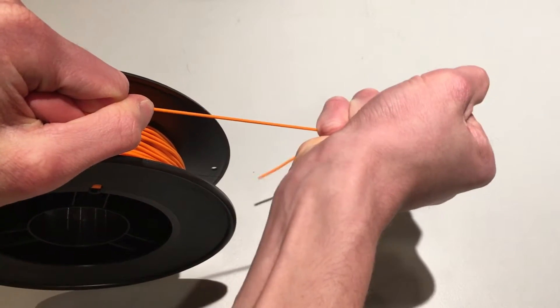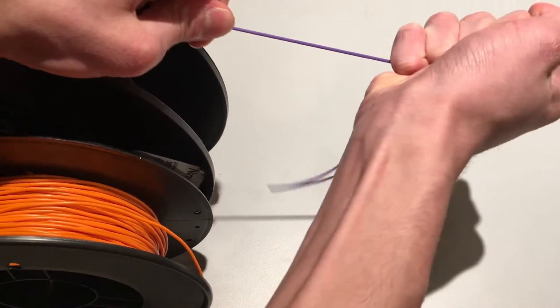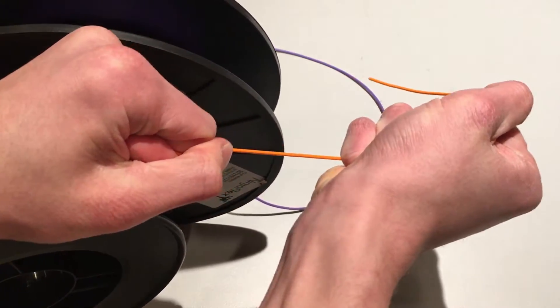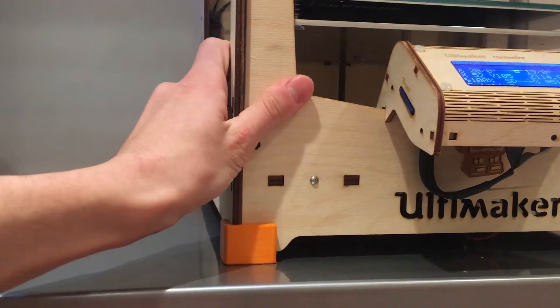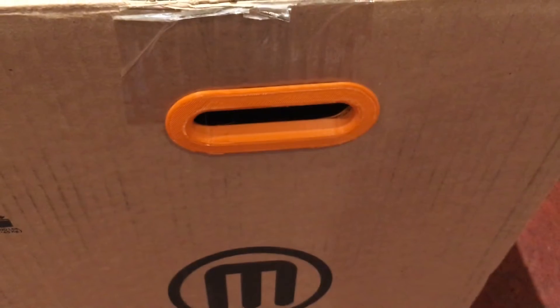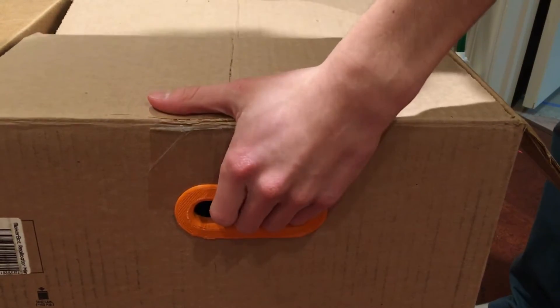The filament is elastic, however not nearly that of Ninjaflex. In general elastomeric properties, I find Willowflex to be in between Ninjaflex and Semiflex, and the compressional properties are a similar case. A very useful property among soft materials is grippiness, and Willowflex possesses this well. I've even used it to make feet for my other 3D printer and hand grips for a heavy box. This filament has a lot of potential uses and applications.